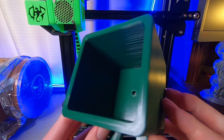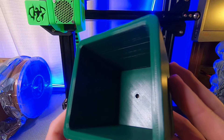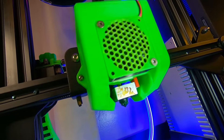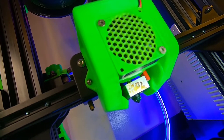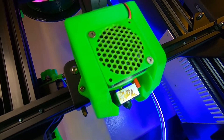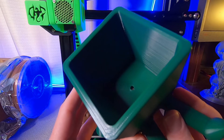On this one it did this whole print — about an 11-hour print — and it did it all while leaking. I had a small leak; it was my own fault. I didn't tighten my heat block on my nozzle quite right, so it came loose. You'll see in the clips — once I pulled my silicone boot off it was covered. But the tip had no plastic stuck to it at all. All the plastic was stuck to the brass and molded up inside where the silicone case was. So we're going to clean it out and run it again — so far I'm very impressed, especially running that well with a goopy leak.